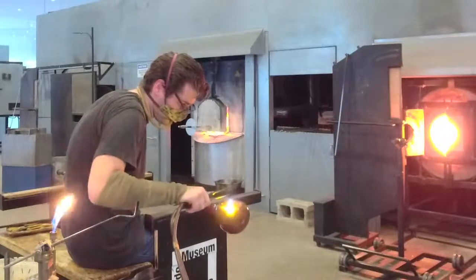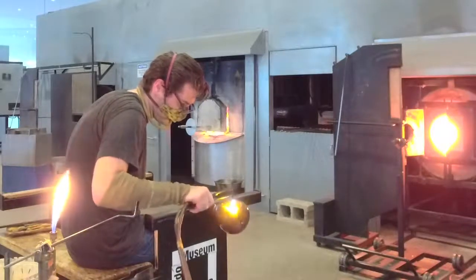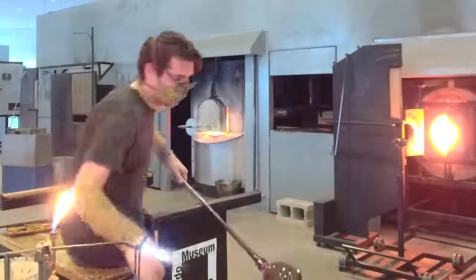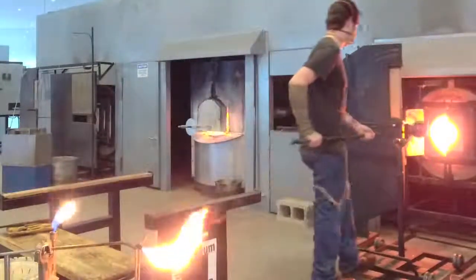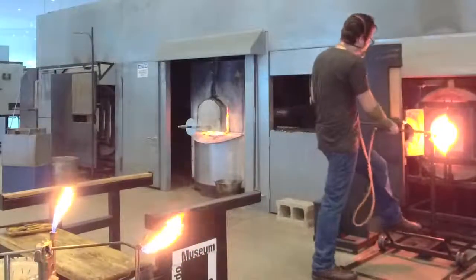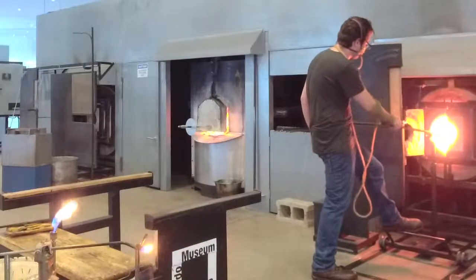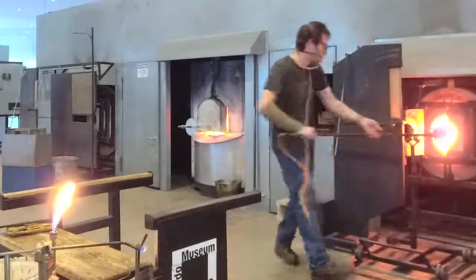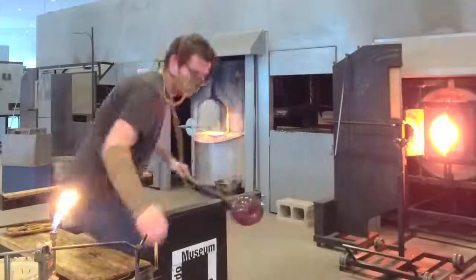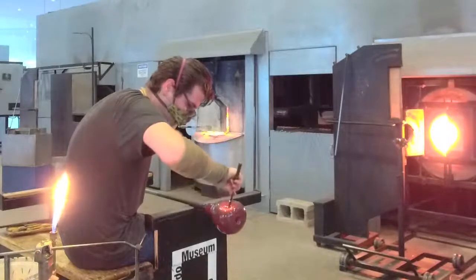He's playing a little bit with the shape, really going in and touching on the detail. The tough thing about hot sculpting is that once you really touch the tools to the glass, the glass is going to remember that. So you can never really undo it. To get it all the way back to molten is going to take a lot of effort and totally change the shape. When we're working in here, you really only have one opportunity to make something nice.